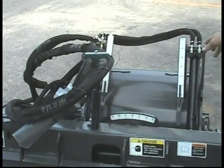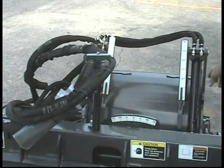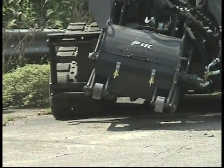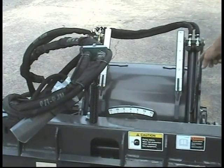It's much more advantageous to have independent cylinders acting on the skids or the depth shoes in order to hold the tilt cut. So when you want to cut 1 inch over here and 0 over here, you can hold that with that cylinder with the down pressure, and it allows you to see that with the 2 indicators.